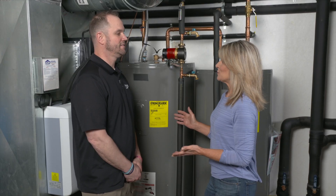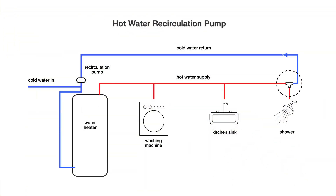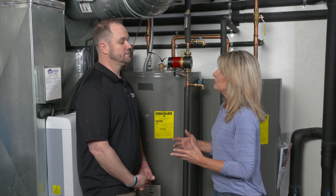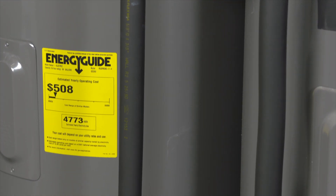Can you walk us through an installation process and explain how the system works as you go? Absolutely. So you put a tee in before the furthest fixture at the end of the house and you run a water line back. It goes through your recirc pump, which then pumps it down into the water heater, and then that pump pumps it out this way. So it's making this constant loop and water is always in there. So when you turn on the faucets, it's instant hot water. Where you save money is at the faucet — that minute you're waiting for the hot water to get there, all that water is going down the drain. So instead of waiting three minutes in a big old house for the water to come, it would just be immediate — right there, right when you need it.